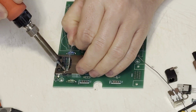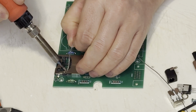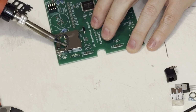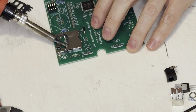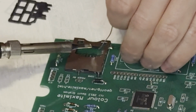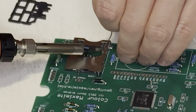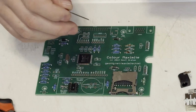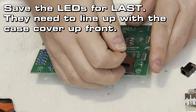What I didn't realize is that once the SD reader was in place, I could remove that, and there I actually removed it. And here I am cleaning up my poor soldering technique afterward, now that I could remove that insertion jig. And these are the leads for the write protect sensor. Please remember those, or your write protect notch won't work on the SD card reader.